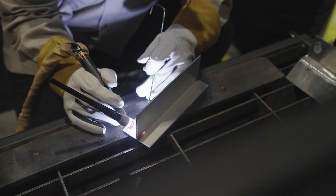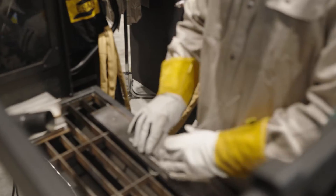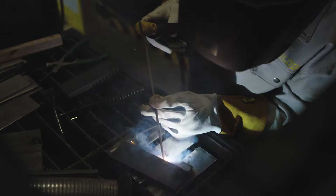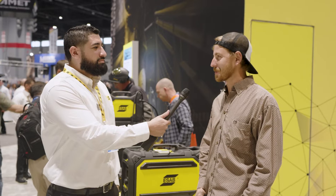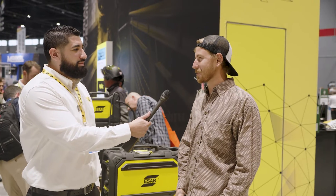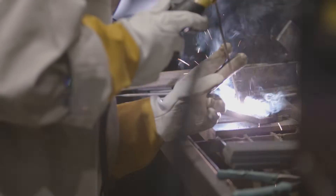It's smooth, I like it a lot. I welded with an eighth-inch and a 3/32 rod — came out clean, almost no slag feel, can't complain. It was really smooth. Shocking that DeWalt batteries could actually run a 7018 eighth-inch rod and weld on three-eighths plate without any kind of preheat — it was sweet.